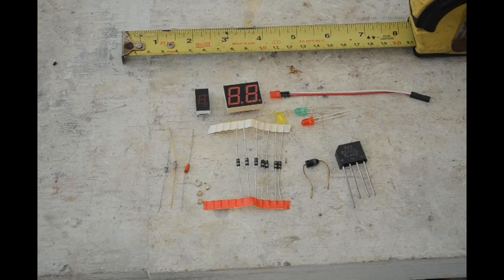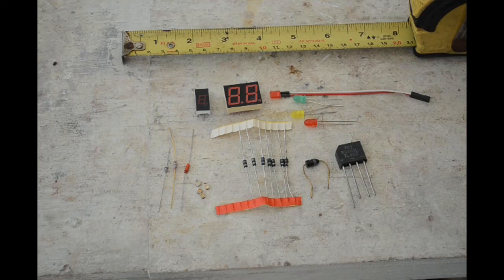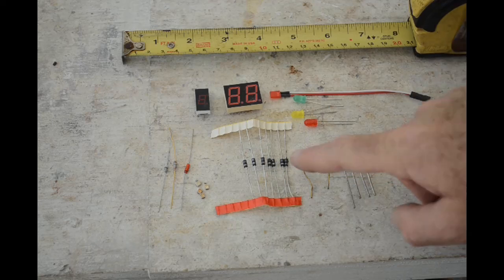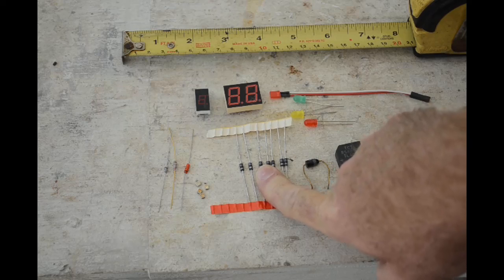Now that being said, I don't do a lot of diodes. I'll do the LEDs because there's a lot of LEDs, and there's a nice gold whisker in each LED. And if I can, I get a lot of these little chip diodes. I took apart some Ethernet switches, and each board in that switch must have had a couple of dozen of these on it, and they all came right off when I depopulated the board. Like I said, I throw them in with my ICs and process them the same way. And I will clip these diodes off of a board if they're easy to get to, and just clip the legs off short.